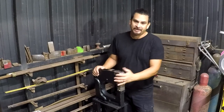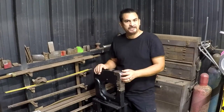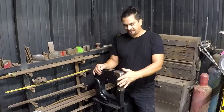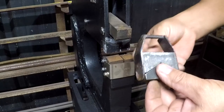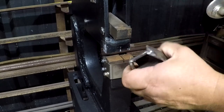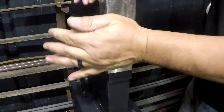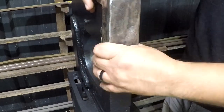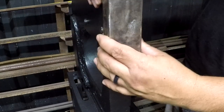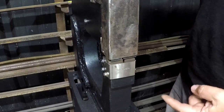So at some point, I think I might like to change this over to a toolless jaw change. I think with some modifications I can get this to be a 30-second swap, if that, to go back and forth between the jaws. I can just remake another one of these, the metal hanger part, and it can slide into this cover the same way as it does with this, and then whack it on there, and boom, you're done. I think if I slot these holes down here, then I can set it up so it goes on like this, and then down, and then I can put a thumb screw up in top here.